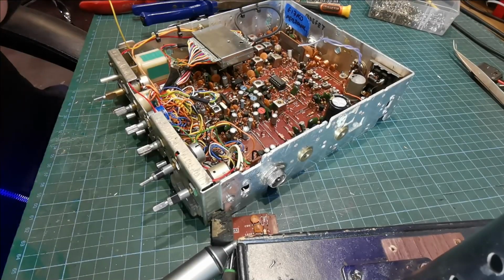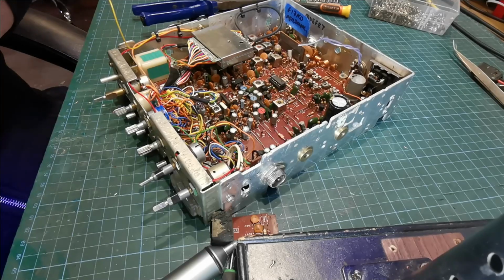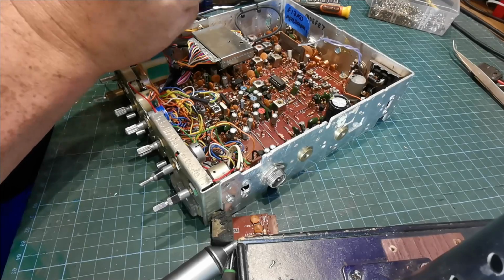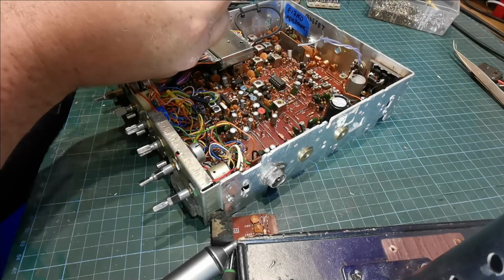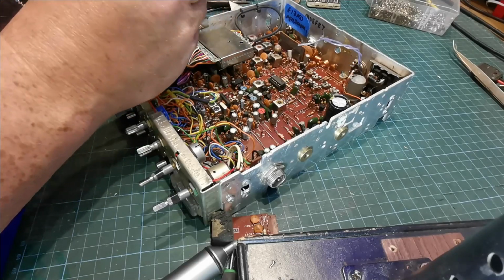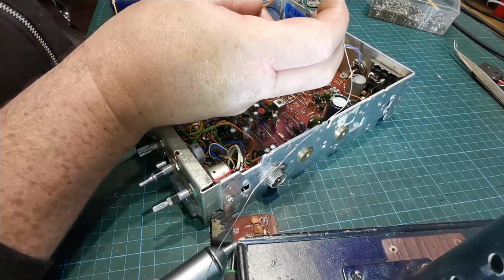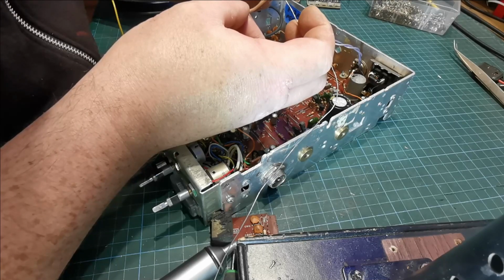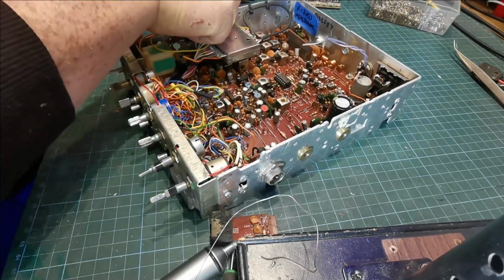We get another little piece of the same wire. Speaker wire, like decent quality speaker wire, is good because it has a decent content of copper in it. So we just strip a very small piece off the end. Now we'll tin that. Now we'll flip her over again.